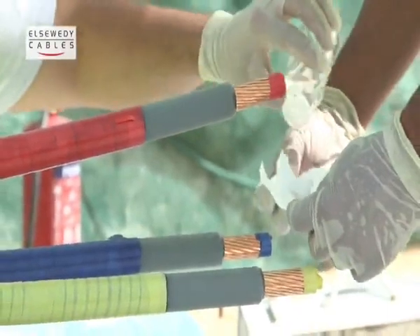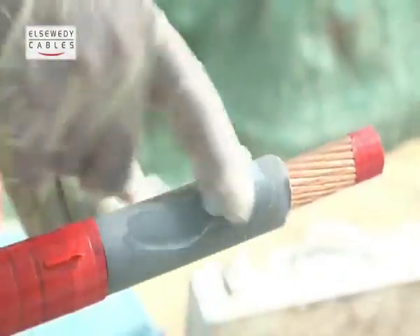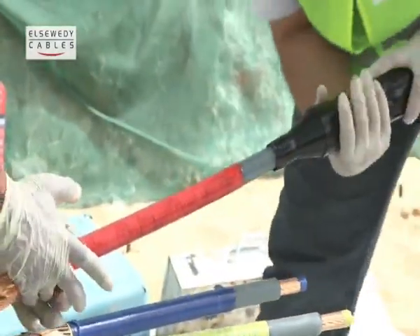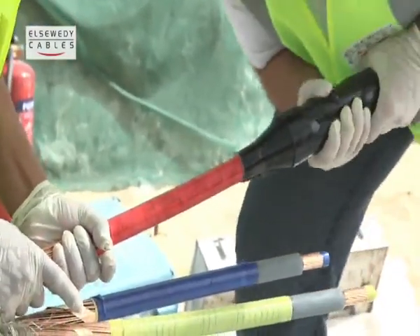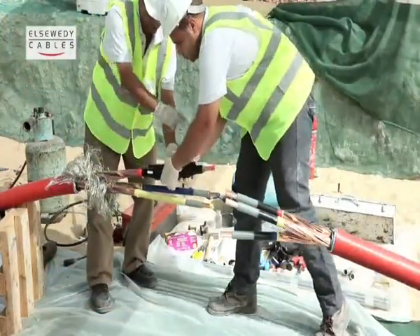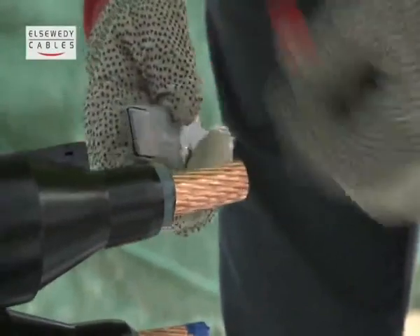Clean and lubricate the XLPE insulation and PVC tape portion of the long-sided cable. Store the housing by pushing and slightly twisting it in the direction of the wrapped PVC tape until the insulation of the cable appears for a length as per mentioned in the instructions. Remove the PVC tape on the ends of the conductor for the long-sided cable.